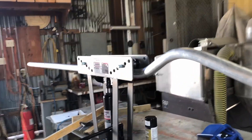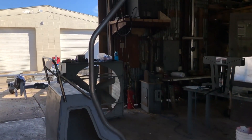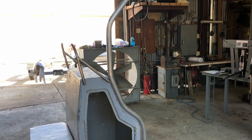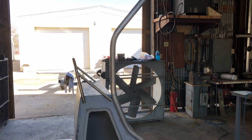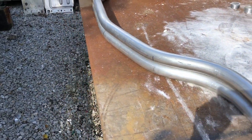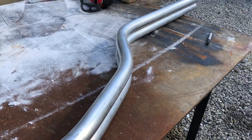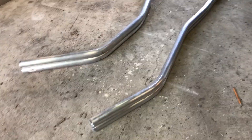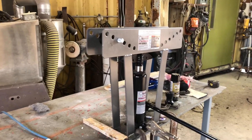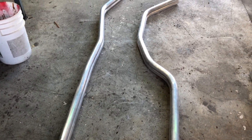This one should bend up until it's parallel with that - it's less than a 45 so it shouldn't be too bad. My first vertical is bent and it basically follows the console. Now I need to bend another one to match it, which will be more tricky. Once you overbend it you're screwed - you can't unbend them - but I think they're very close to identical. Now we've bent the front tubes too, which are simpler. End of day one: we have four verticals and they came out really well. Tomorrow we'll cut some horizontals and maybe tack the side frames together.